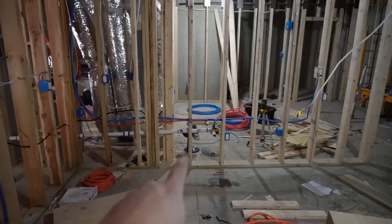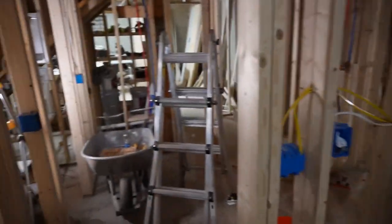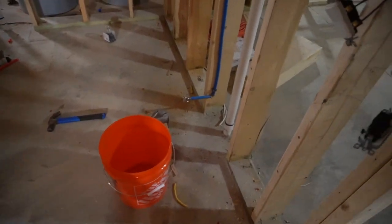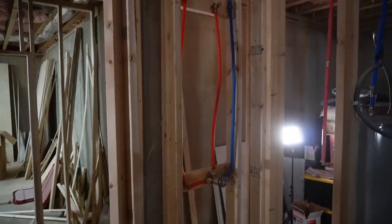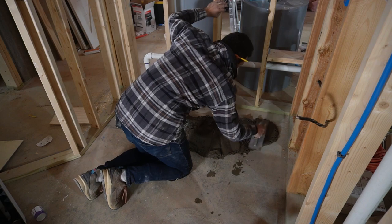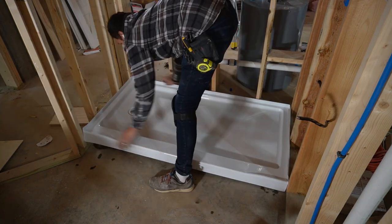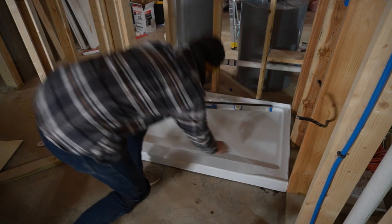Here's a quick overview of the layout: the sink, dishwasher, and ice maker for the fridge are close together. The bathroom has the vanity, hookups for the washer and dryer, the drain, dryer vent, shower, and toilet. After getting the bathroom all stubbed out and the new water heater installed, with all water lines and drains run, I could move on to actually installing things like the shower pan. I used a sand mix to help set the shower pan, which practically eliminates any creaking as you shift your weight. Once you get the drain in, level it out and don't touch it for a full day.